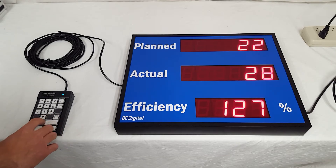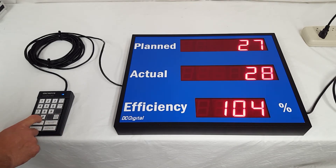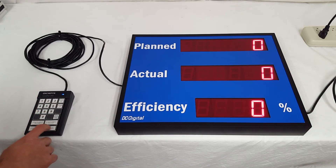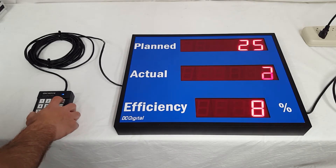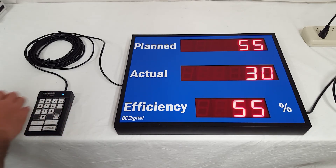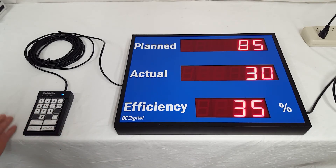Now I'm going to put in parts per second. I'll do five parts per second and push Enter. That gives you a rate of five parts per second — probably more suited to a sensor-type application or PLC application rather than a human-intervention switch.